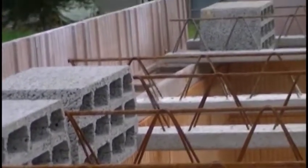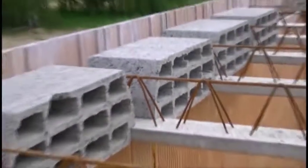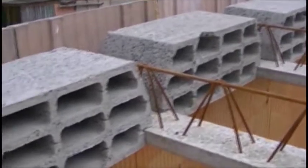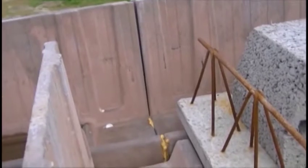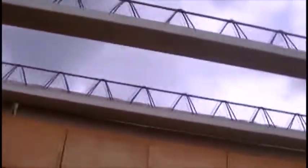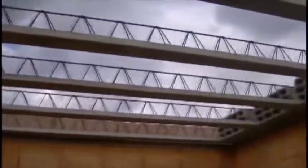Marginal blocks must be inserted at the time of laying the beams, just as is done in the movie, because if you don't, the spacing between the beams will not be parallel, and you will not be able to push the hollow blocks further between the beams, which will result in the need to dismantle part of the ceiling. It looks like a child's simple system, and indeed it is so, apart from the fact that it is one of the more responsible tasks, and if you miss the basic principles of construction, you can cause a catastrophe that could put you and your employees at risk of serious physical injury and cause considerable financial losses.